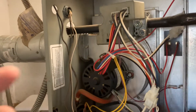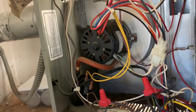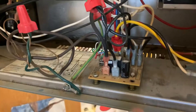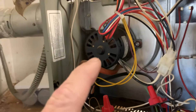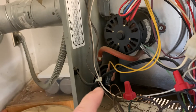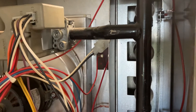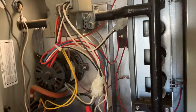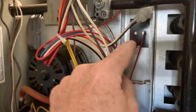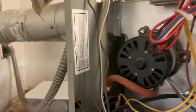As you troubleshoot, just follow the clicks. The first thing that happens is the exhaust motor turns on — you hear that spinning. If that's not working, that's the first thing to check. If you get no clicks at all, check the motor or the control board — it may be bad. Make sure that motor is spinning, make sure the pressure switch clicks, then the element heats up, and a few seconds later you should hear louder clicks as the gas valve opens. You hear the ignition — the 'whomp' as all the burners ignite. That runs for a few seconds while it confirms flame at the bottom sensor, then the blower motor kicks on and it should stay running. If it stops after that, you may have a high temp limit problem, a rollout problem, or something with the gas valve not working correctly. Remember, the gas valve diagnostics LED can help with that.